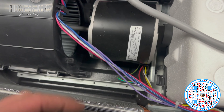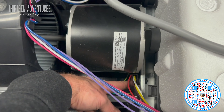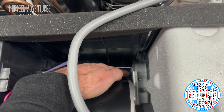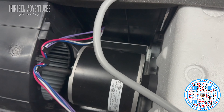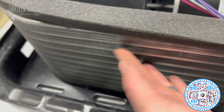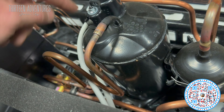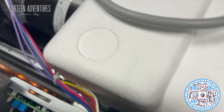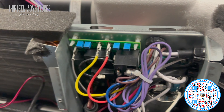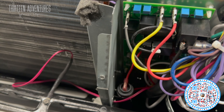I wondered what's up here. Some people have problems with the fan — that's because these bolts have come loose, so that's something you should check. Also clean the fan blades, make sure they're all good all the way around the back side. But this is your compressor here, and all the wires coming into that.